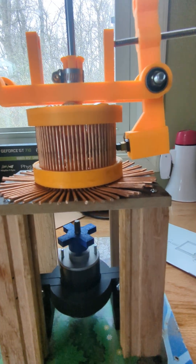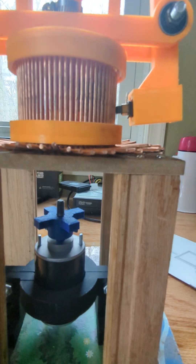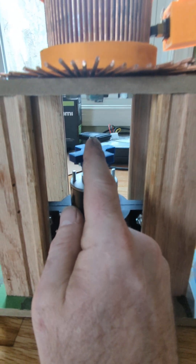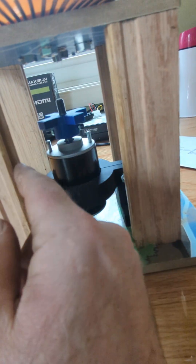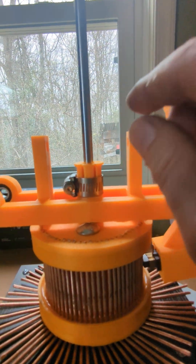So I'm still thinking about that part. I can't put the brushes down here because wires have to connect from the slip rings to the brushes. There's no way to get it through there. So therefore, those slip rings have to be on the exposed side.